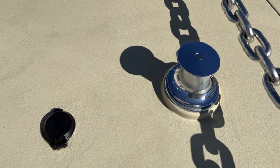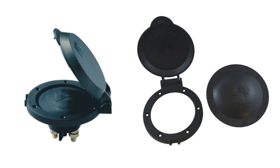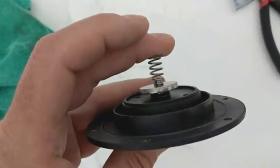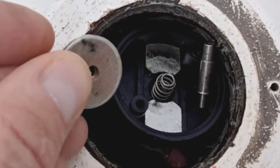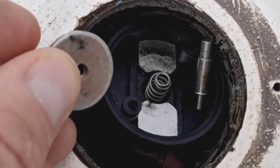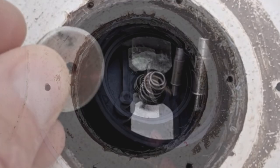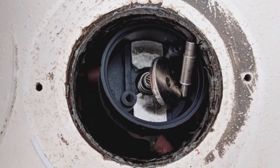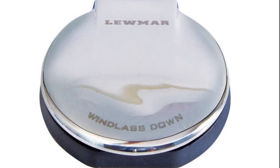Furthermore, these winches are typically operated with a deck-mounted waterproof electric foot switch. The 2 common points of failure with these foot switches are caused either by water intrusion or, more often, their improper use by the operator. These winches typically draw between 60 and 120 amps, so failing to both deliberately and fully engage the switch creates an intermittent, weak, or poor electrical contact, which will cause the electricity to arc from one contact to the other and can burn up the switch in just a few seconds. It's a good idea to carry at least 1 spare foot switch with you.